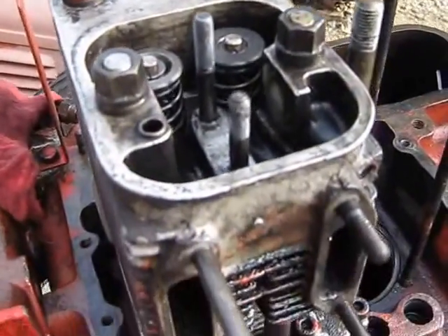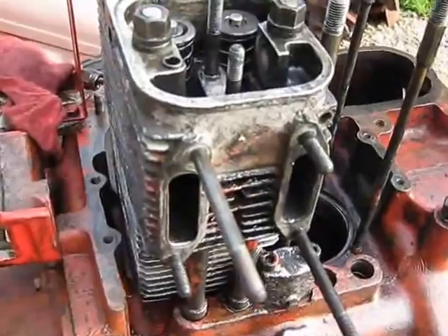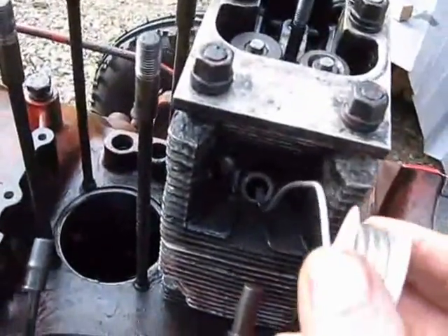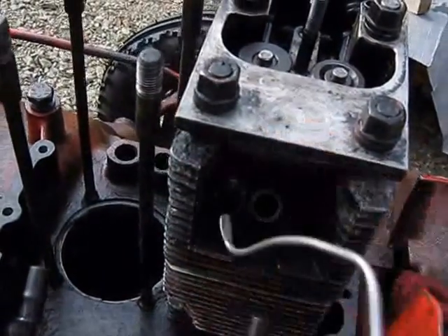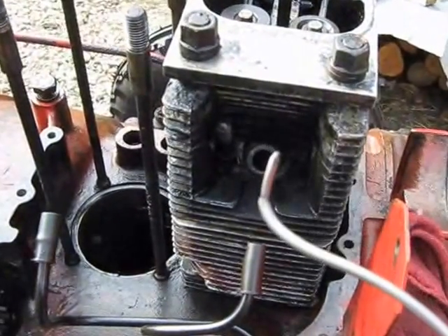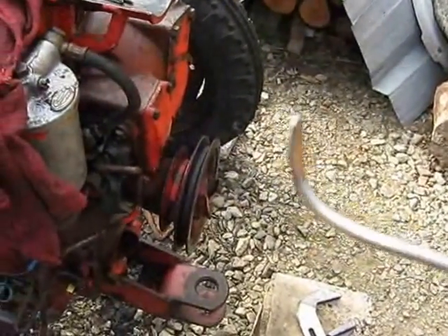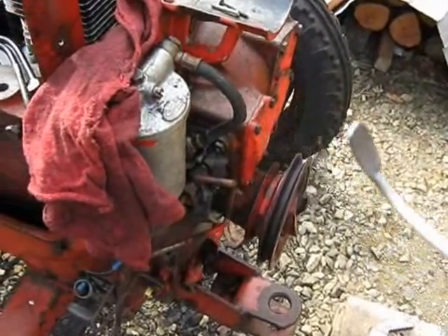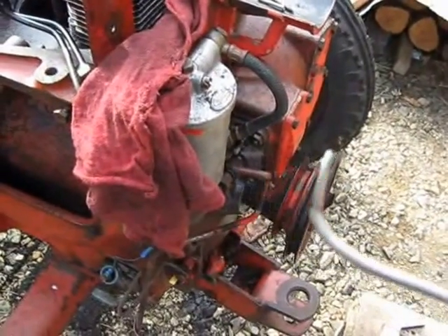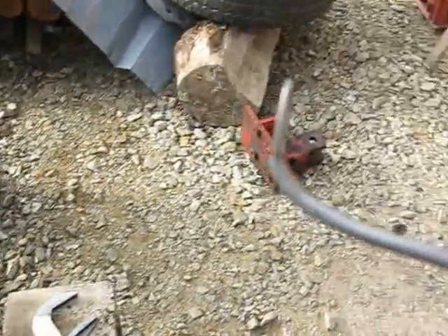And the cylinder head — I haven't worked out just what torque that's going to be yet, but it worked a treat. You have to do bumping clearance for the cylinder head piston. You push a piece of wire down there, wind the cylinder over, and it squeezes the end between the piston and the cylinder head, and you have to measure that. It has to be between 36 and 42 thou, I think — I'm only guessing, but it looks about right. You have to do both. If it's less than 20 thou, the piston might hit the cylinder head, and that won't be good at all.